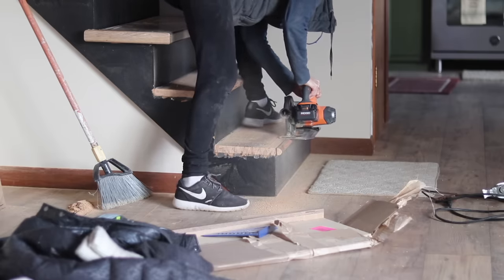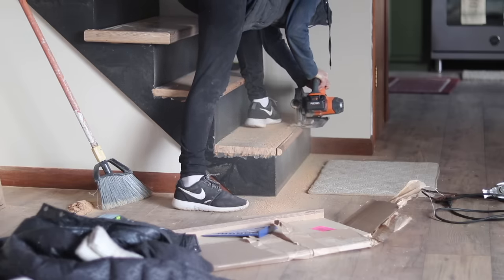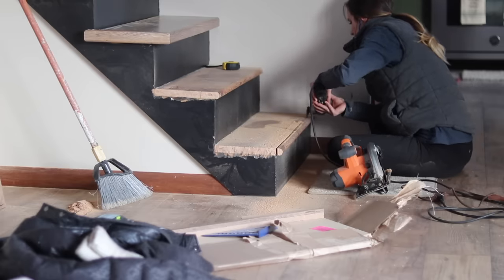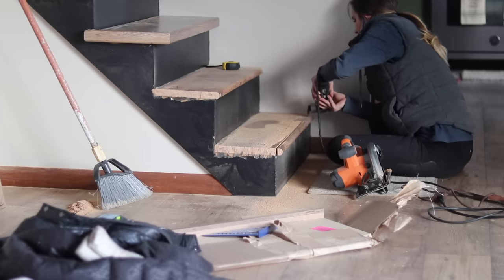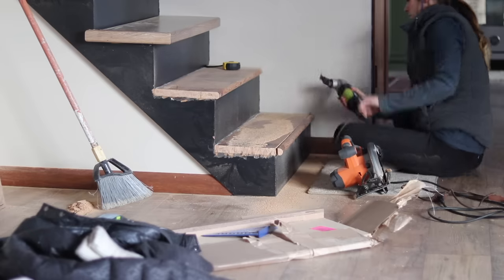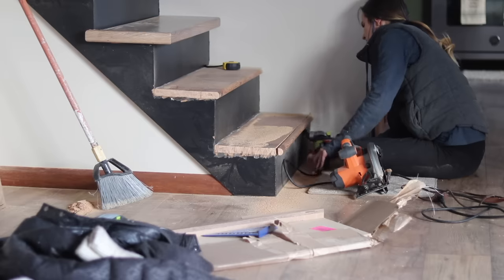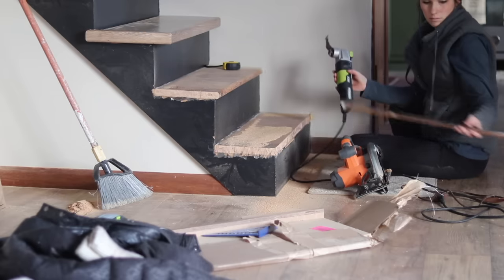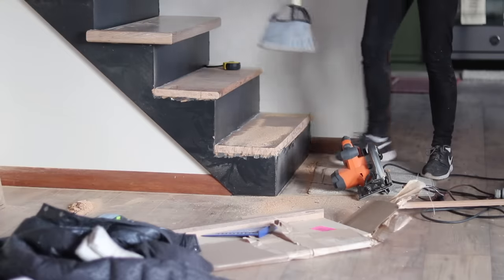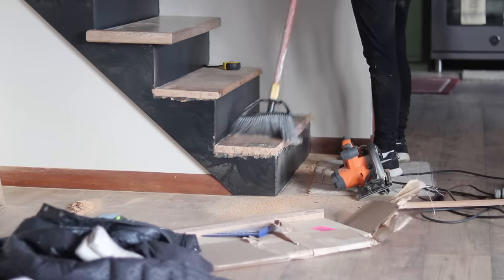Here I'm using a circular saw — I drew a straight line to follow, and this went smoother than the jigsaw, although still not foolproof. The overhang on each of the laminate treads will cover any imperfections, so I didn't have to fix or touch up after the cut. Again, where the circular saw couldn't reach, I used an oscillating multi-tool. I could not do any DIY without this tool — there's a link to it and all my favorite tools in the description.